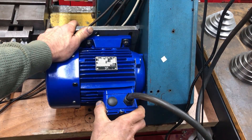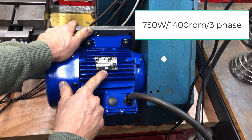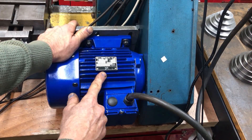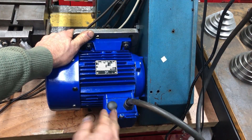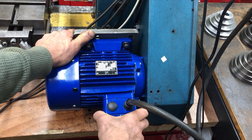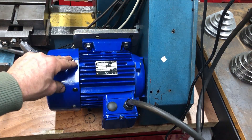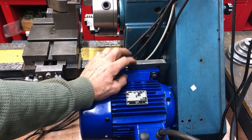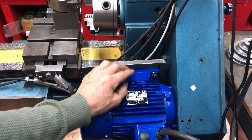This is the system I use for the motor, changing positions on the belt just by lifting the motor up — I think that's at least a good compromise, just using those three speeds I can get by changing the belt position. This is a one horsepower, three-phase, 750-watt motor at 1400 RPM. I have another one which is flange mounted which is a little bit more powerful, but what happens is the belt slips if I really stress it, so I think this motor should be sufficient. It's also reused from my first stuff, from the counter shaft motorizing system on an ML7.